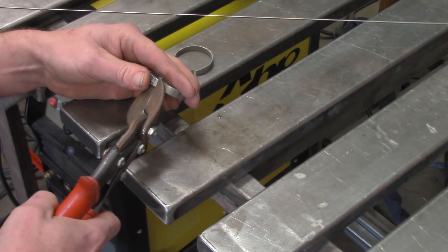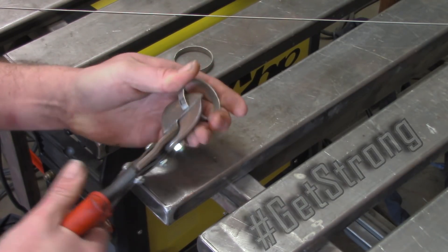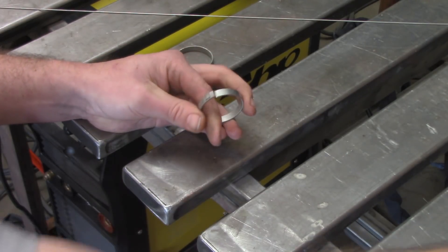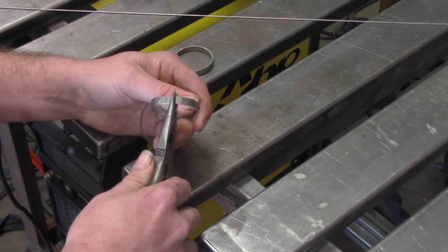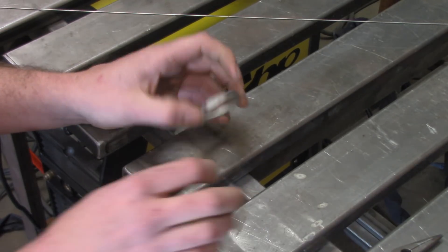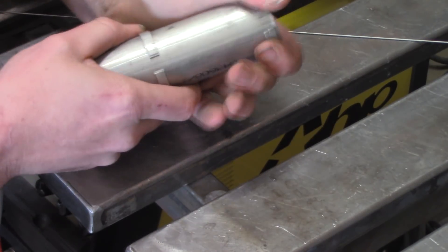Now, once I have it cleaned up with the grinder, I'm going to go ahead and grab a hold of my tin snips and we're going to split it right up the middle. Then I'm going to grab a hold of the pliers and kind of straighten it out a little bit, because the tin snips tend to distort it just slightly. So as soon as I get it straight back to pretty much even, we're going to spread it only slightly, just enough to get it around that inch and three quarter.